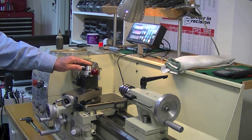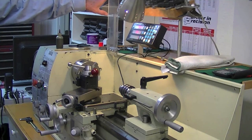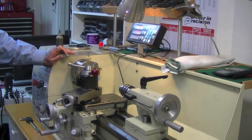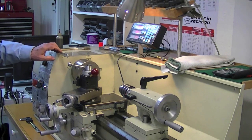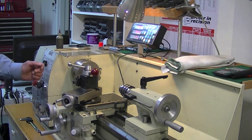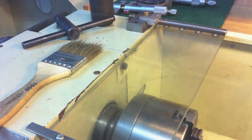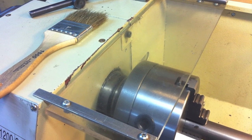This is a Phase Two quick-connect tool post, and I added a shield over the top of the chuck that also is an electrical disconnect. So if you're running the lathe and you lift this, it turns off the power. To restart, just press the green button. This is the method I use to stop the lathe all the time rather than using the other switches.